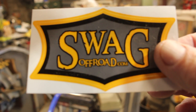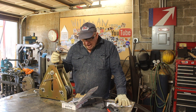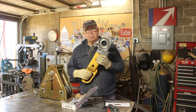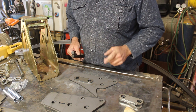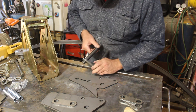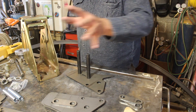They sent me a sticker, so I'll put that up on the wall. I also decided to get the bottle jack adapter that replaces this screw with a four-ton bottle jack, and the electric drive adapter. I was able to get on Craigslist and find this for a hundred bucks — this is the electric pipe threader gadget. Now all four plates are the same, but you've got to remember that there are two left and two right sides. You align these ovals onto the plate, and there's an oval opening on the back here, so we'll just come in there and plug weld that, then do that to all the plates.